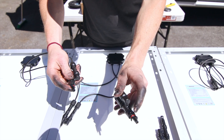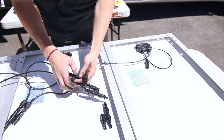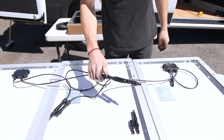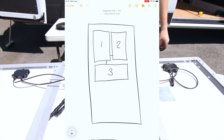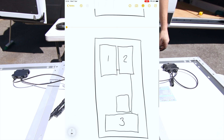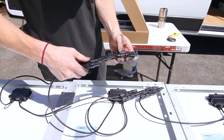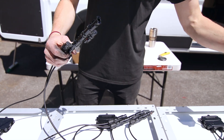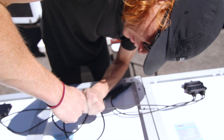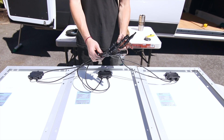This is the positive one and this is a positive end again, so clipping that together gives you your last final positive wire. Three panels side by side like this doesn't leave a lot of slack in the lines, but if you arrange your panels differently it can leave more slack. You can also purchase extensions from Renogy if you need to separate your panels more. Now clip the last connector and connect your last negative wire there as well. With six different wires they all funnel down into these two endpoints.